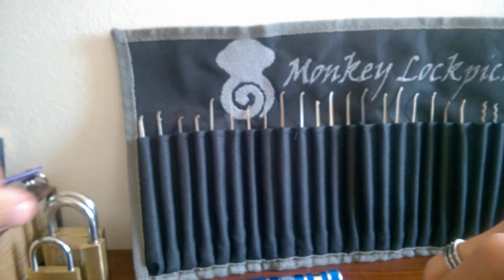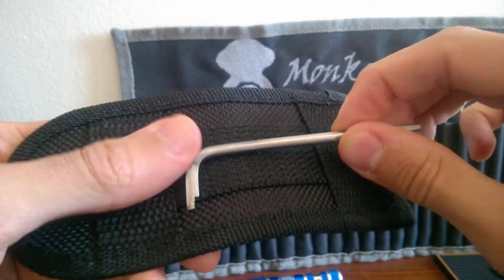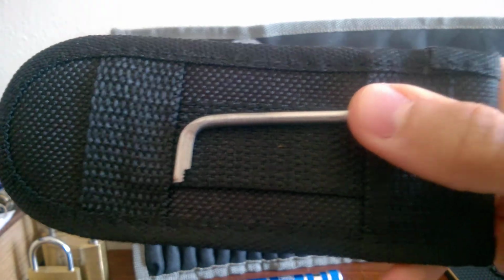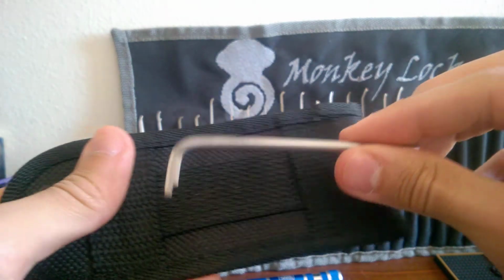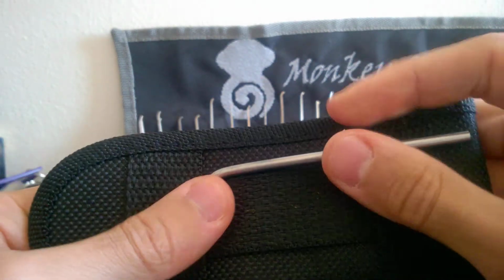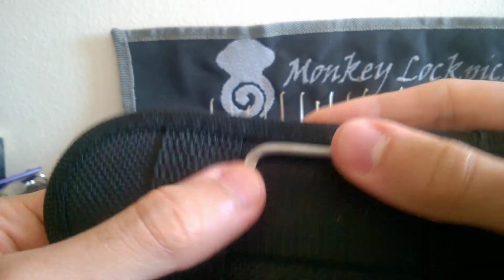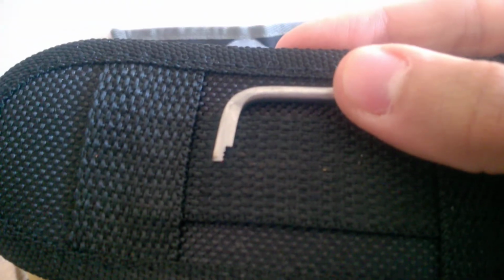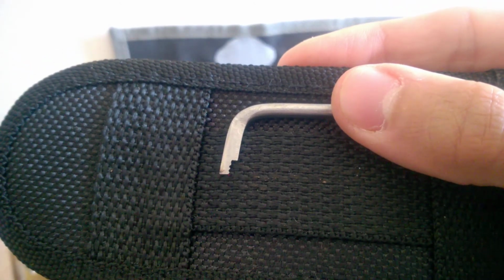Okay, a quick look at one of the tension wrenches for the top of the keyway. These are in stainless steel 4mm bars, pretty hard stuff to work. I ground down the tip so it will fit perfectly in the locks, and I also thread the tip a little bit to give it a more secure grip to the lock.